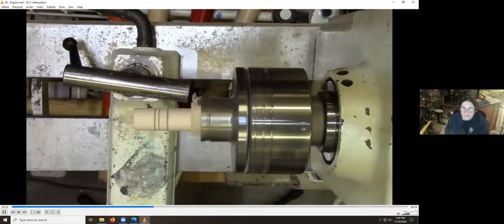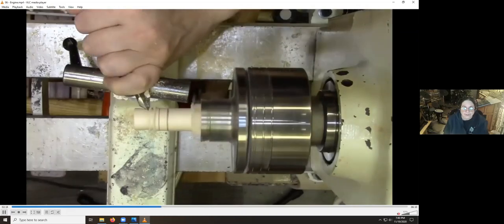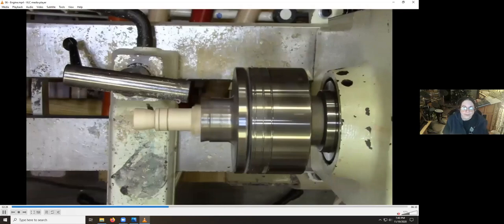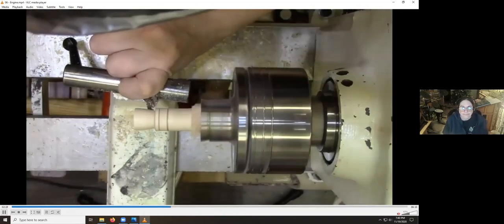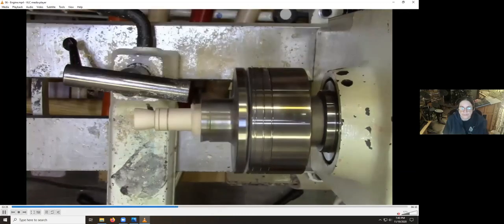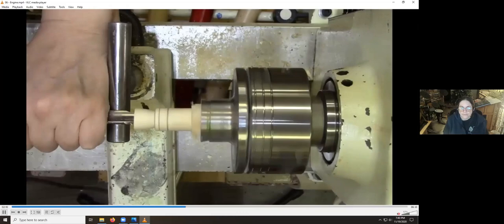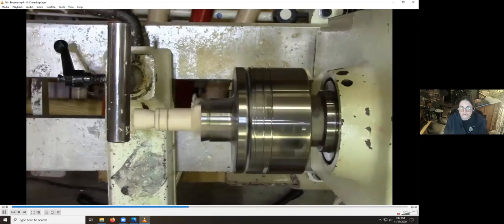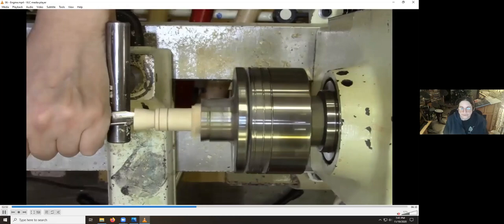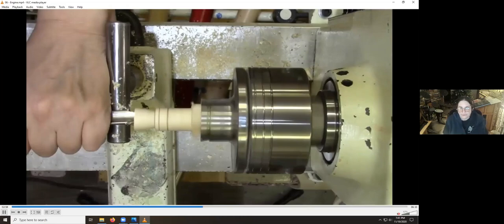For the engine: I've turned it down to a cylinder and drilled a little recess into the engine cone — basically you're making a really tiny goblet. I'm tapering it before I go in and hollow the goblet part. Then I'll go in where I've already drilled and just round and smooth it a bit, refining the shape of that hole. It doesn't need to go all the way down to the bottom — it's there for show, it doesn't have to be even-walled. I'm doing basically a little parabolic curve in there as best I can; I just want it smooth on the inside.